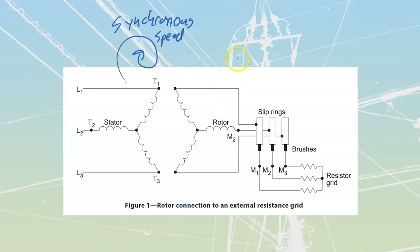What we have on our rotor is going to be a little bit different. Our rotor is not going to be made out of that squirrel cage we saw before, where we have circles and bars shorted out. What we actually do is remove the shorting on one end, and then we have just multiple windings — multiple wraps — and we take those leads out of the motor on slip rings. Slip rings are solid circular rings mounted around the shaft of the motor, with insulating material between the shaft and the slip ring, and then a brass or copper ring on the outside. All we need to do to take power out of that circuit is have a brush riding up against it. It is a continuous circle, always making contact — it's not a commutator doing any switching, just carrying power directly out. We refer to this rotor as being the secondary circuit of the motor, because we still go through that whole transformation idea: this is the primary, we supply power in, it creates a magnetic field, that magnetic field cuts across to the secondary winding, the secondary creates a value of voltage, we carry that voltage out onto the slip rings, and feed it through to a resistor grid on the outside.